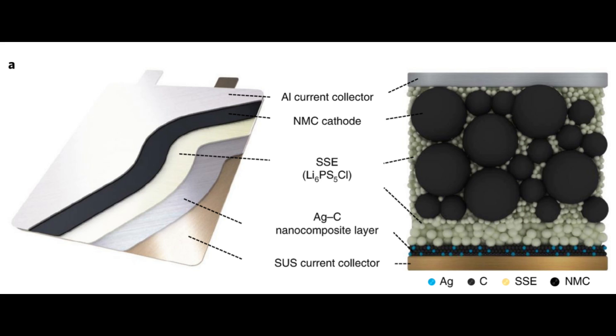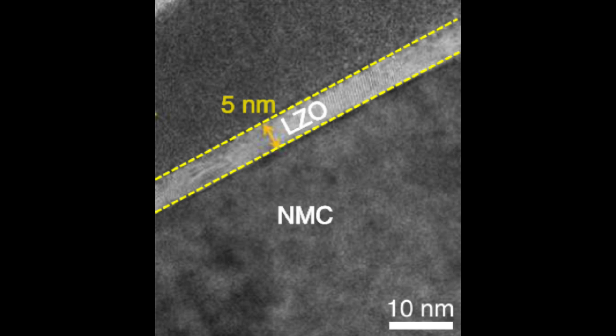Without this access, the cathode materials buried deep in the cathode wouldn't be able to take part in the charging and discharging of the battery. Two, there's also a layer of pure electrolyte illustrated with slightly larger white spheres, similar to the liquid electrolyte layer in a typical battery cell, which allows lithium ions to ferry back and forth to and from the electrodes. There's also a layer mentioned in the research paper that wasn't shown in the diagram. The researchers applied a 5nm layer of LZO to the cathode material. LZO is a combination of lithium and zirconium oxides, and its purpose was to protect the cathode material from unwanted side reactions that occur when voltages go above 4 volts. The LZO layer was necessary because the battery was cycled as high as 4.25 volts.